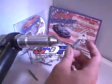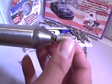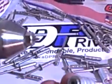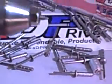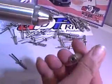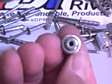Take this one out, put this one in, and activate the trigger. Sets the rivet. Reverse the drill — it ejects the nail. And here we have a rivet where the nail is nowhere near the front.